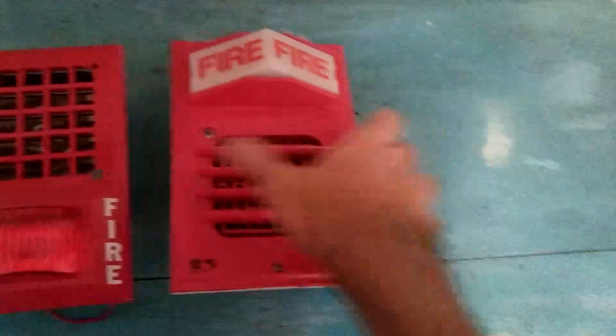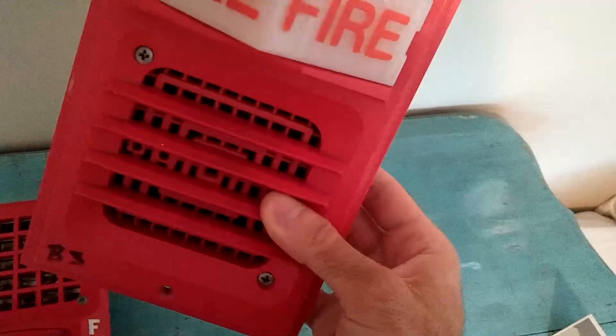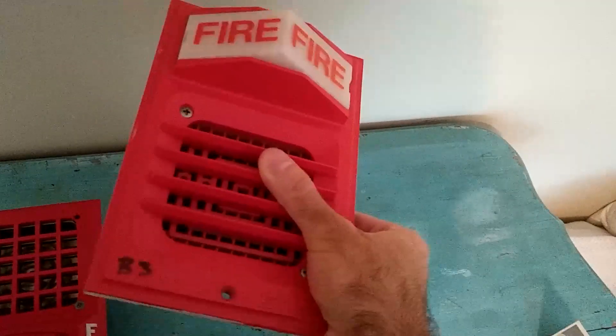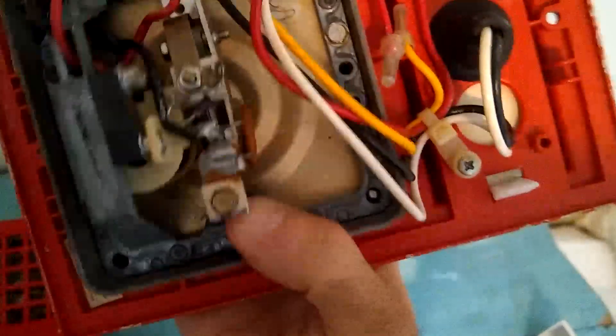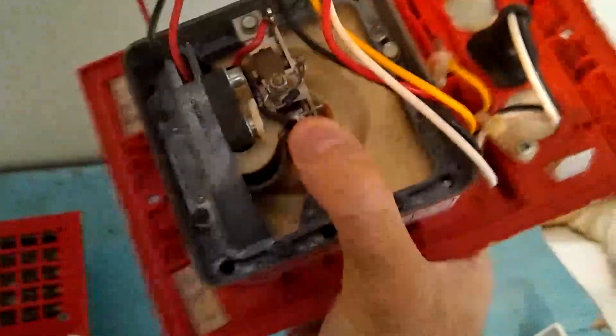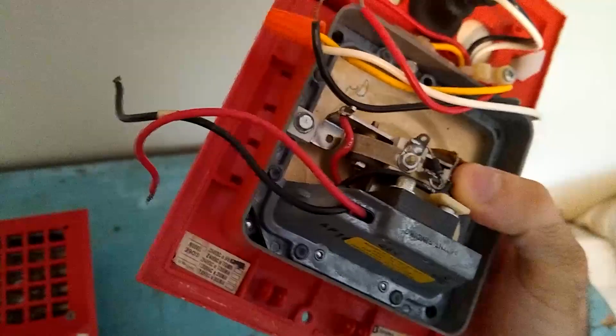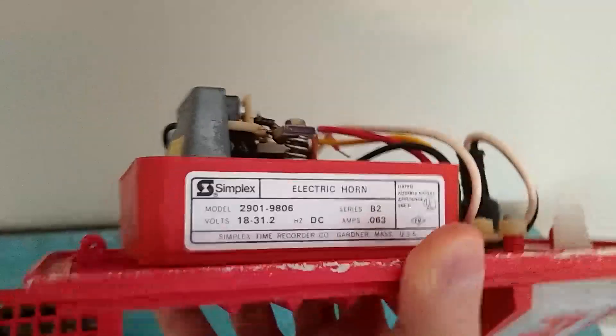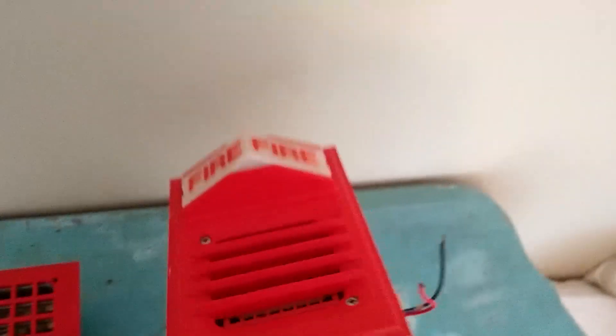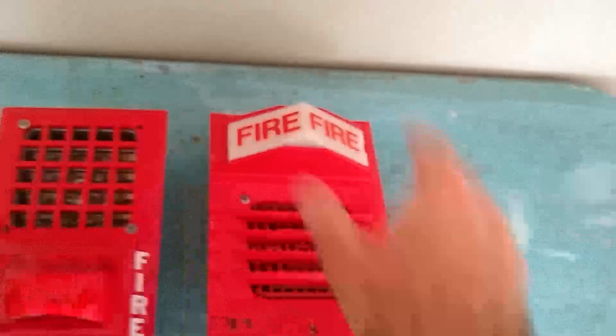Moving on, we have the B-Series Vibratone. This one is a Series B2. You can see more reinforcements were added to the grill. This one is behind my Simplex 2903-9001 light plate and is a little different. The electromagnet coil shrunk. The hammer can be seen more easily. There's a bit of a gold tint here — not sure if that's due to oxidation or some special coating. There are two wires sticking out. You can see the tag right here. This is labeled as the 2901-9806 by Simplex, and this one only draws 63 milliamps. This horn is also very loud, almost as loud as the A-Series, but probably not quite. I would say it's a more efficient consumer of power.